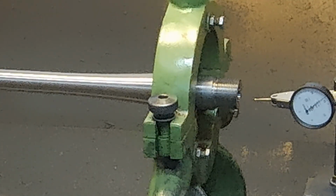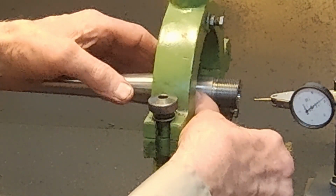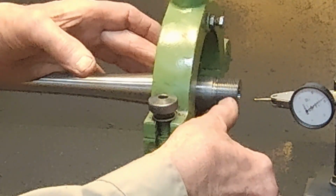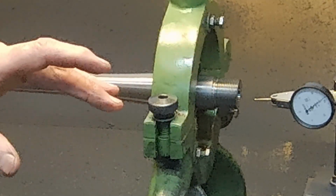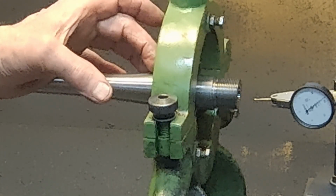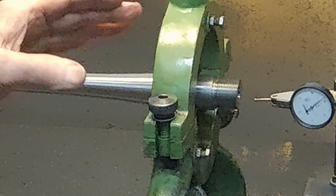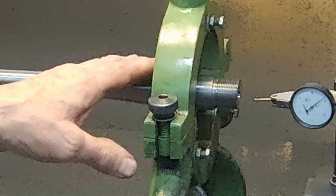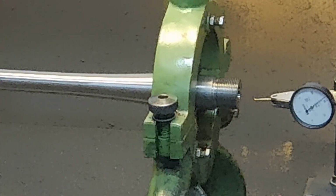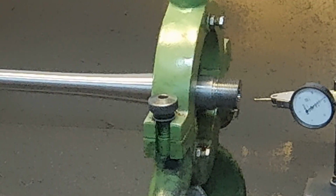If you have a curved bore and you just set up and dial in at each end, and you can reach up far enough to dial in right at the throat, then you can go ahead and pre-bore, and you'll get a chamber that's aligned with and concentric with the throat location. Now, it won't be quite in line with the rest of the barrel because, as I said, the rest of the barrel takes off in an unknown direction as soon as you get past there. But so you can do that.